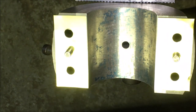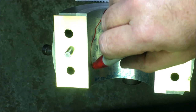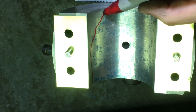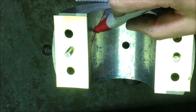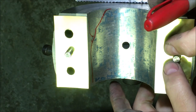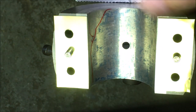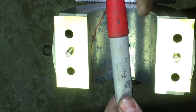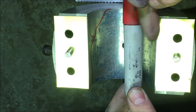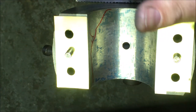of this. That bit I'm not bothered about. This bit is where that bit of pitting is, and it sits on the operator side. So it's away from the direction of the spindle. So if you like, it's inverted. So as the spindle comes out here, it's this section on the bearing. So I'm not overly fussed about it, because it's not a surface which is being pushed against.